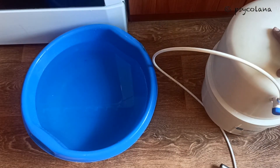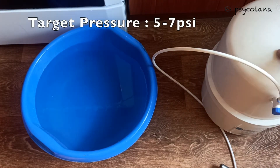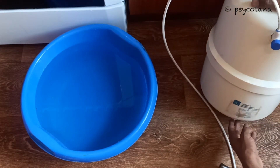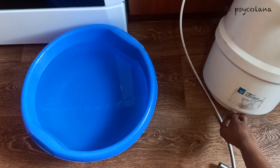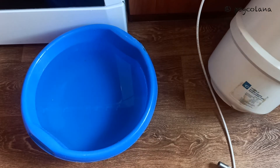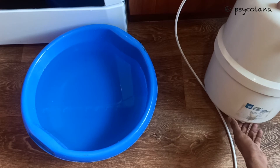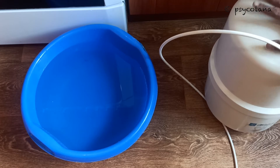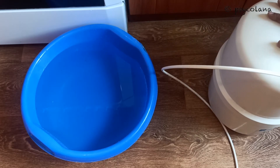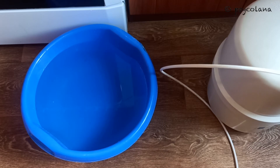After draining the tank of dead water, inflate air to the required pressure, that is approximately up to 7 psi. If you have any water leakage by your valve, then you have to replace your tank. So far I don't find any leakage, so the tank is okay. Also, the water is not smelling — if it is smelling, the tank needs to be replaced or cleaned with chlorine. This arises if the RO system and tank has not been used for a long time.